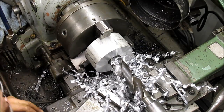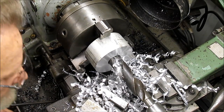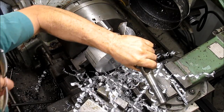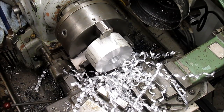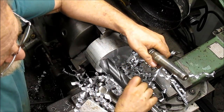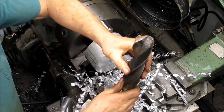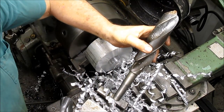You're wondering why I'm using a Crescent wrench on this old drill bit. It's because somebody actually brought this bit down from a number five taper to a number four taper, and when they did that they cut off the end — which is the exact thing that grabs on the inside of the tail stock. So I don't have a grabber on this. But I only paid five bucks for this drill bit and it works fairly well, so I'm happy with it. I've just got to grab it with the Crescent wrench.